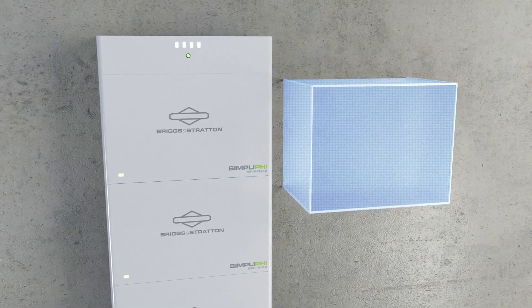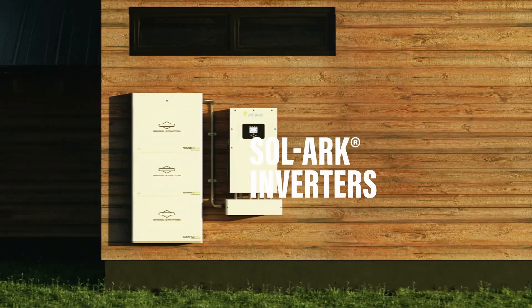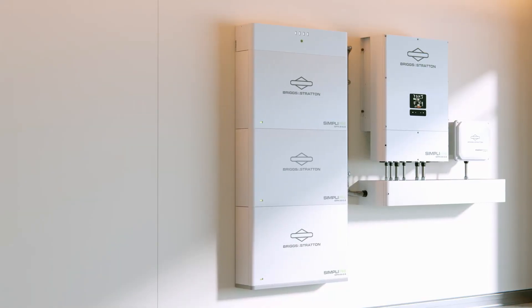What are my inverter options? Do you have specific partnerships or closed-loop systems? As a battery company creating agnostic relationships, this battery will pair with any lithium-supporting inverter on the market without comms. We do have closed-loop communications with Sol-Ark and with the Briggs and Stratton inverter. We've tried to take the complexity of dip switches and other configuration steps that other batteries require, and we're embedding it all into the software and firmware of our battery — so it really becomes just plugging a cable into the CAN bus of the inverter and battery, and that's it.